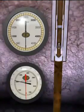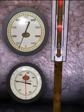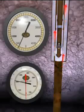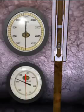We verify that we can circulate and we record the pump pressure. This will ensure that the drill pipe, liner and annulus are filled with clean mud and hydrostatically balanced. From this point forward, the liner will be running into the open hole where all operations must be carried out as efficiently as possible.